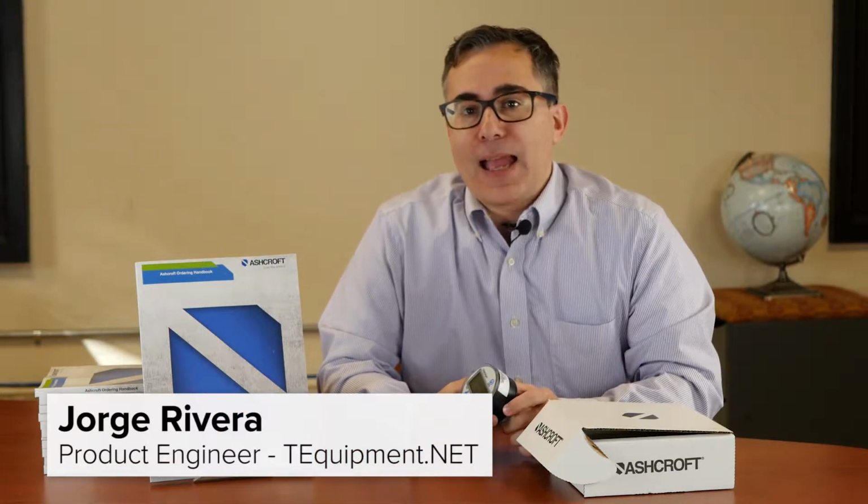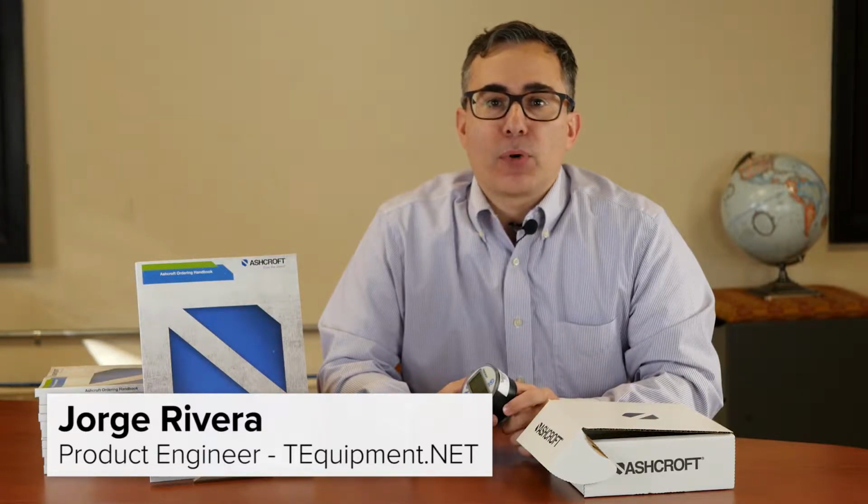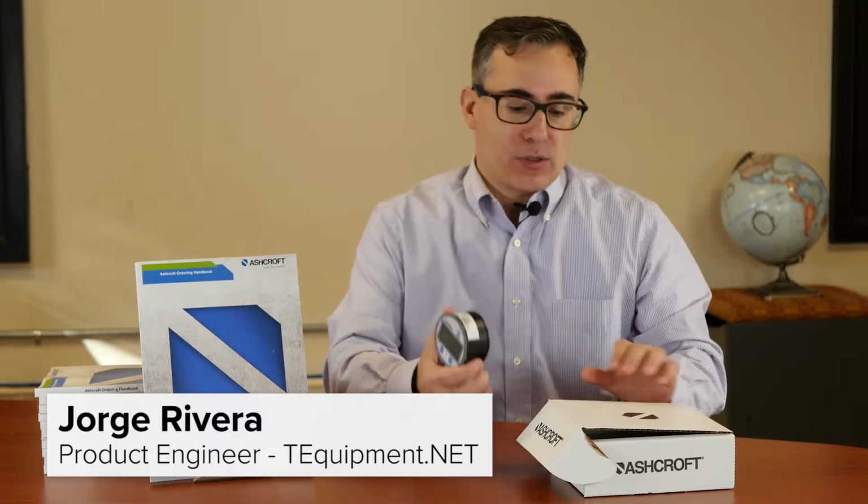I'm here to talk about the Ashcroft DG25 pressure gauge. It's a digital gauge, comes in a box similar to this. Very industrial type gauge because of the accuracy ranges. It's 0.5% is standard, 0.25% is optional. Ranges from vacuum all the way to 25,000 PSI.